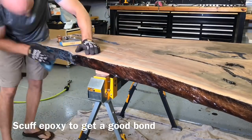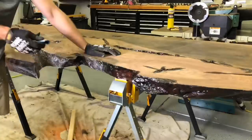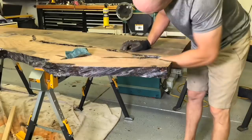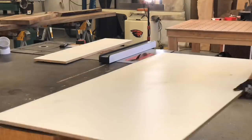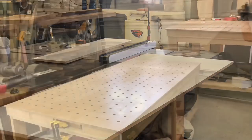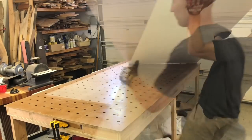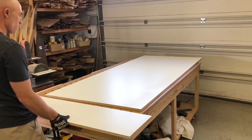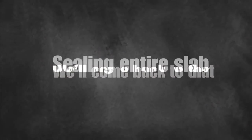The people that don't seal the edges do so because they feel you get a better bond with the epoxy actually penetrating the wood — I do agree with that, so if you do seal them, make sure to scuff it up to give a good bond. Here I'm going to start making the form, and I use melamine. With mold release you can actually reuse these forms over and over again. I'm cutting my sides — this table is going to be longer than a standard 8-foot sheet of melamine, so I have to put an extender piece in, caulk that joint, and put house sealant tape over it.